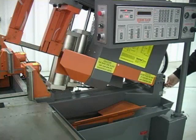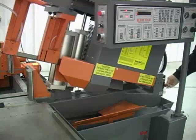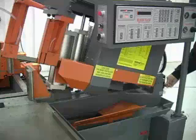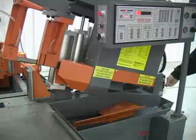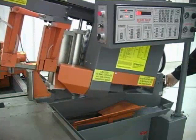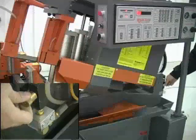The feed rate control regulates how fast the arm moves through free air and sets the maximum rate of travel. To slow down the traverse rate, turn the feed rate knob clockwise. To speed up the traverse rate, turn the feed rate knob counterclockwise. Turning the feed rate knob all the way closed to the right will prevent the arm from falling as long as there is air pressure to the saw.